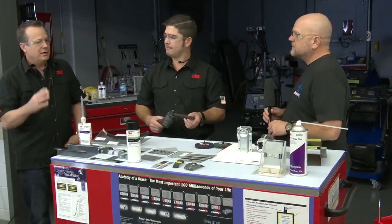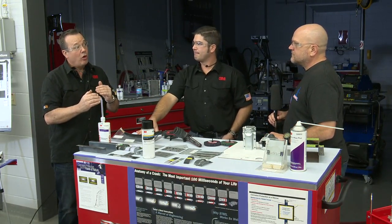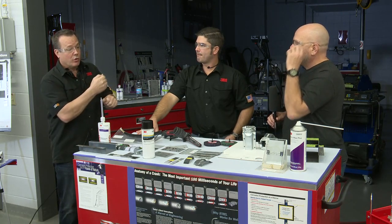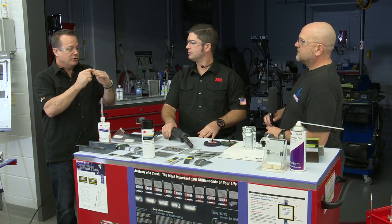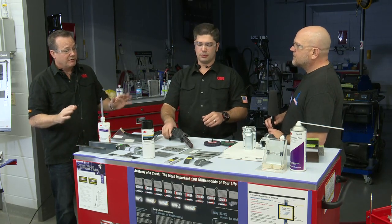To me, you're theoretically not even trying to go all the way through the top panel. You're trying to make the top panel paper thin. Yep. So with your panel separator, you can finish it, and then you don't go into the bottom panel at all. The ideal cut is when you still have a little high spot where the weld is, not a divot. Divots need to be avoided.